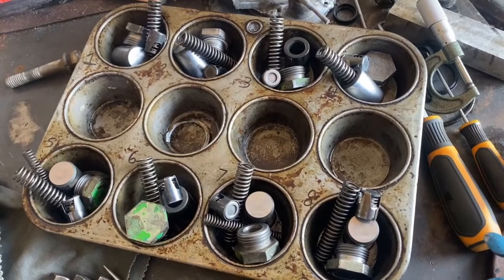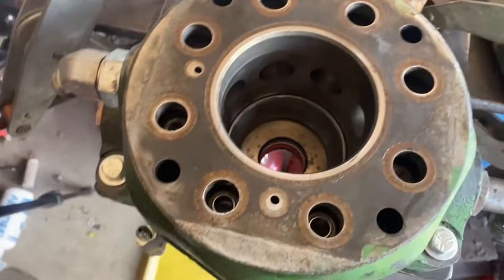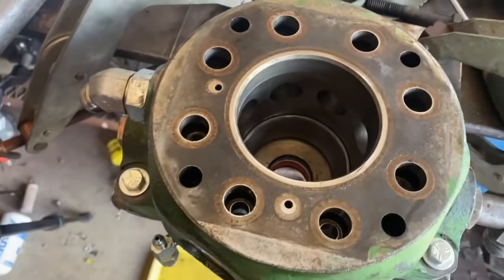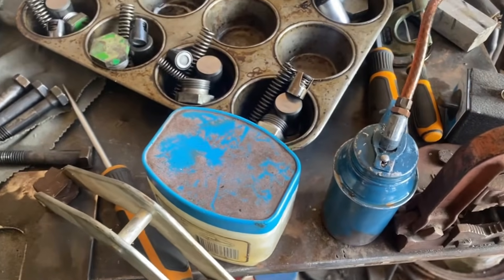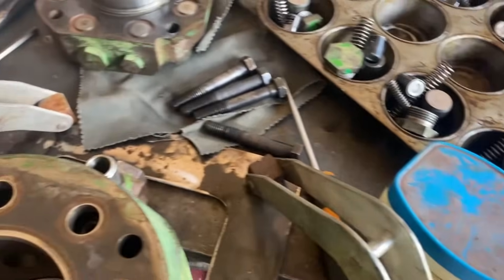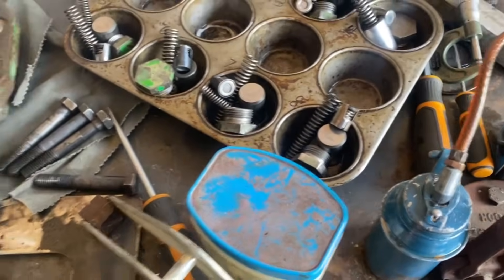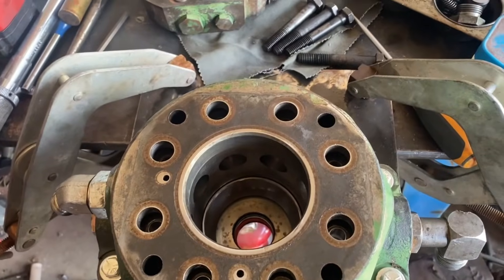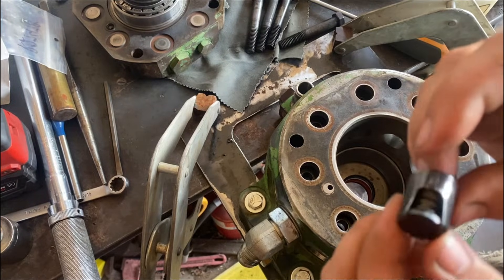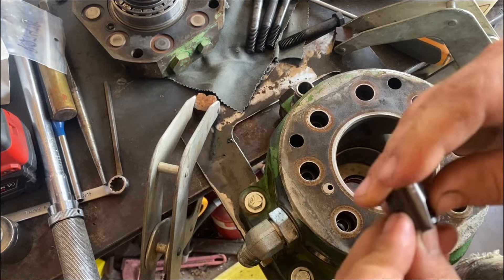I like a muffin pan to hold all the parts — numbered one through eight. I started with number one and went clockwise around one through eight. I used Vaseline to stick and hold things, with hydraulic oil for general lubrication. These are the exit check valves. I took them apart and flipped all these discs. You can buy new ones if you want, but there's the old side.